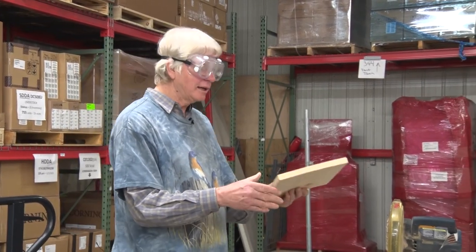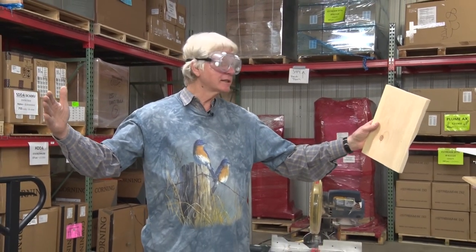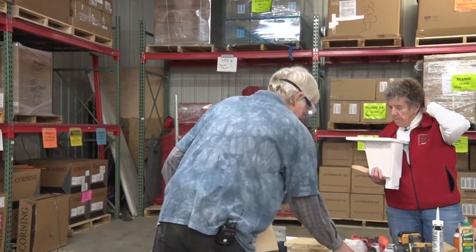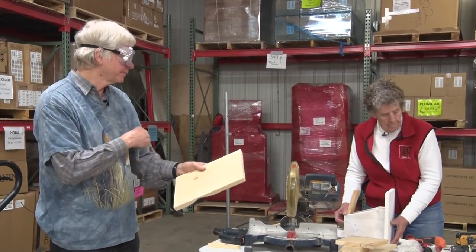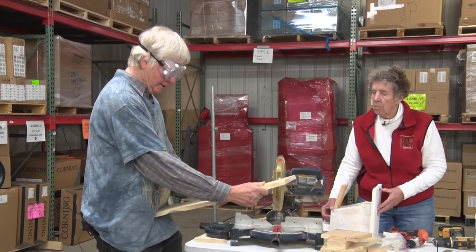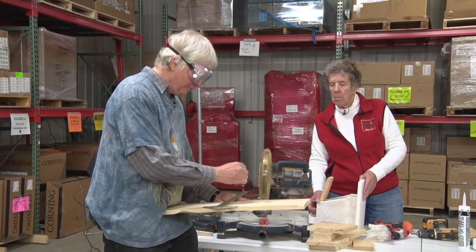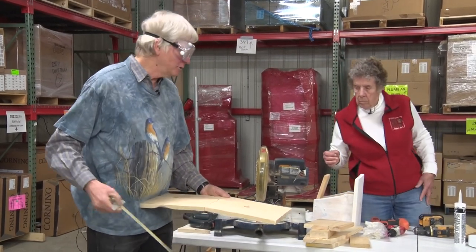That's right. When you buy your board, it will be 8 feet long. I get an 8-foot section, a 1x10, of white pine. Okay, 1x10. And I do the same thing for that. Your roof is going to be 12 inches long, exactly a foot. So on your 8-foot board, you just measure 12 inches, make your straight line, and cut along that line using your miter saw.